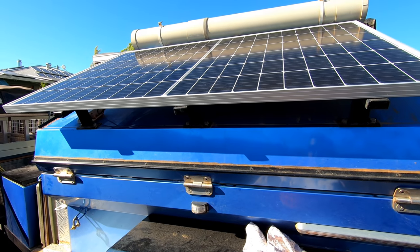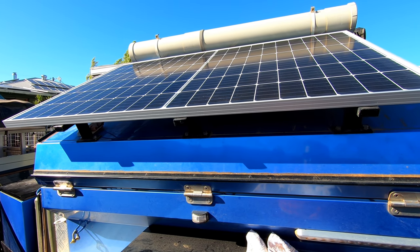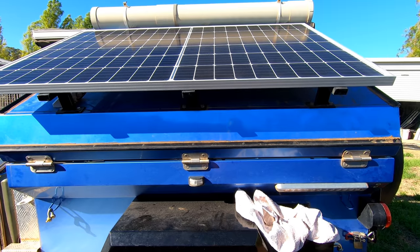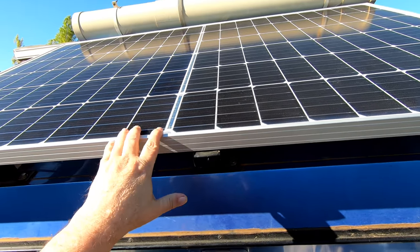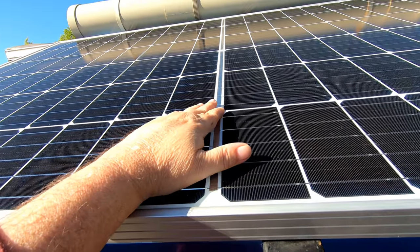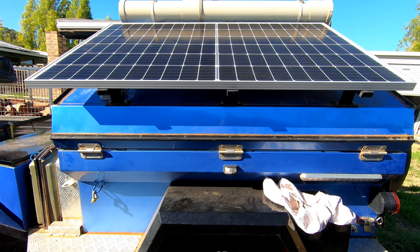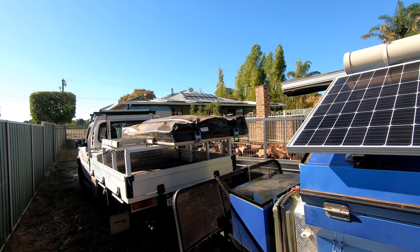So it doesn't matter how you shade it, because shade moves during the day as the earth spins - which gives the illusion of the sun moving across the sky. As the earth spins and the angle of the sun changes, your shade moves across your panel. If you shade a third of the solar panel right on this middle bus bar, your panel will stop producing for a little while, but not all your panels are going to be doing that. So are they still worth getting? Yeah - I've got no shade on my house roof at all, and I've got panels at all sorts of angles to catch the sun, so I've got constant power all day.